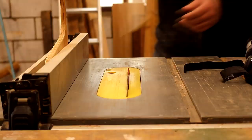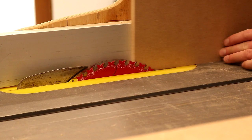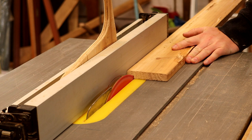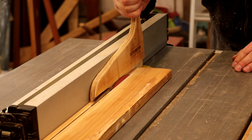This will be fine. I set the distance between the table saw fence and the blade to the exact thickness of the 12mm MDF that I'm using, making sure that the blade just caught as I pushed the piece through. I then ripped a piece of the pine to that measurement, then I could rotate and run it through again so that the cleats would be square.